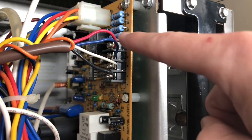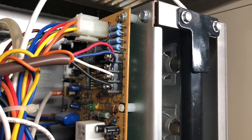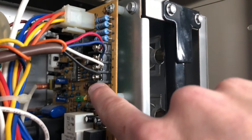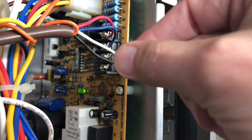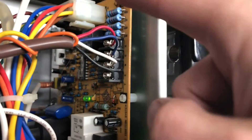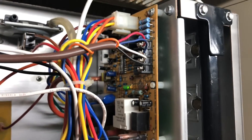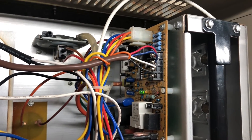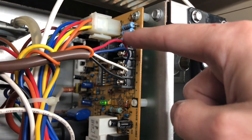You're going to need three wires for sure, and optionally you can do four. There are four terminals on this particular unit — it's like a 45,000 or 50,000 BTU heater. All you simply have to do is loosen the screw, put the wire underneath that contact point, and snug the screw back down. I've done that, and then I have the corresponding colors on the other end at the thermostat.